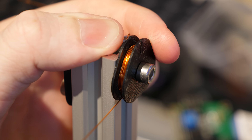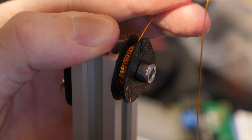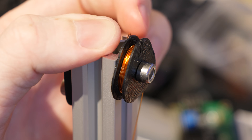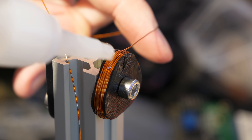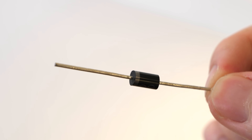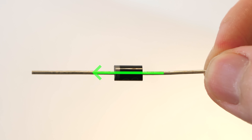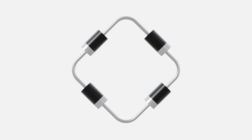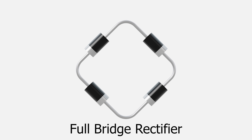I then started winding wire around a 3D-printed template to create the alternator coil, but we also need something to turn the alternating current into direct current if we want to power something like a light bulb or an electric motor. To convert AC to DC we need to use diodes, which are essentially one-way valves for electricity. Current can flow through in one direction but isn't able to flow back the other way, and if we arrange four diodes in a specific formation we've built what's known as a full bridge rectifier.